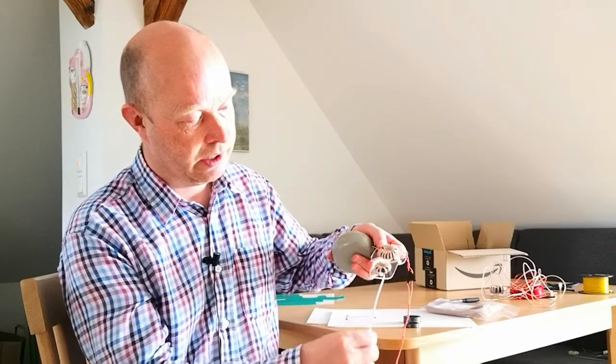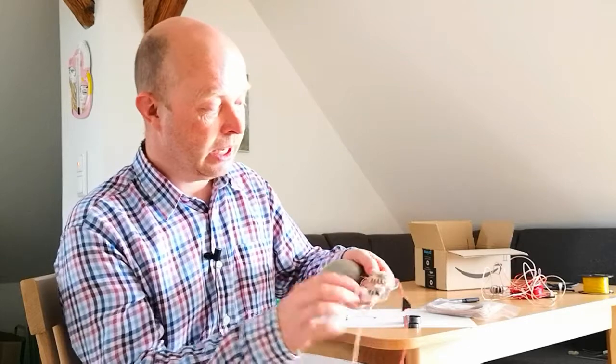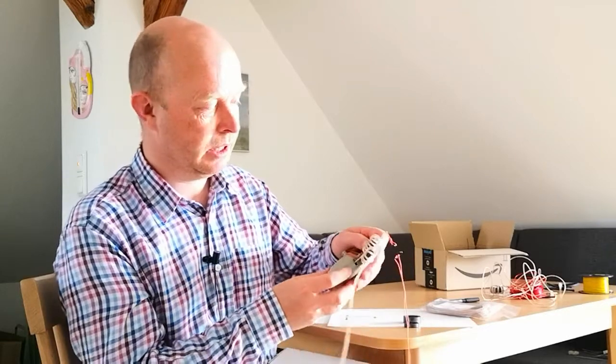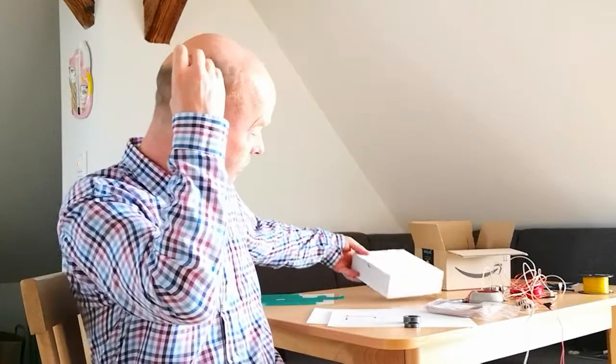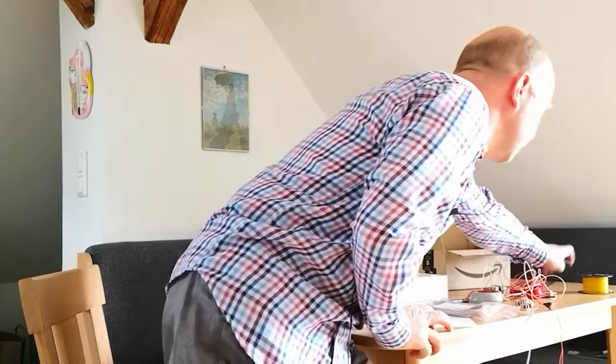You can see what I've done. I've put the heat shrink tubing over the coax to make it thicker, and then I've wrapped it around the ferrites, and it just stops the jacket from getting damaged. And in this antenna that I make, you're going to see I'm going to extend it further along the jacket, because where it goes into the reel, it also takes a bit of abuse, and it needs protecting there.